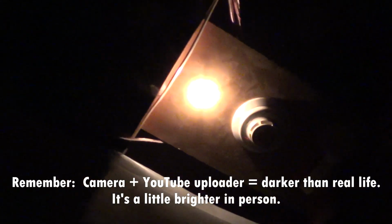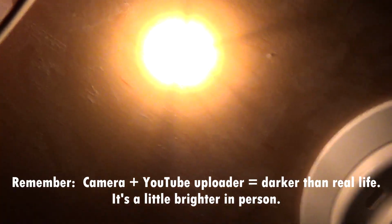So you can see it got a little bit brighter in here, and that's because I have a system of emergency lights also set up. And they're just the basic 24-volt lights. I've got one there. And this is the reason I put this board over here: as you can see, that light right there is directly over our sump pump, so that you wouldn't need to bring a flashlight down here to see it, to plug it into the generator.